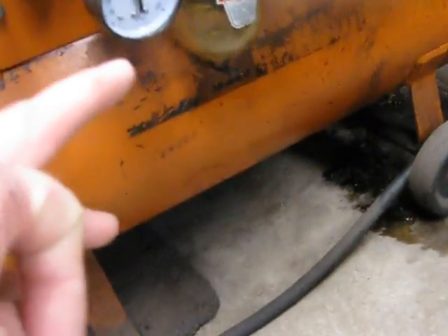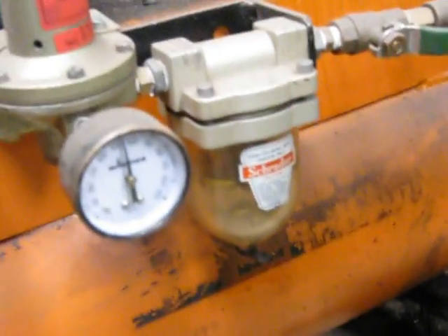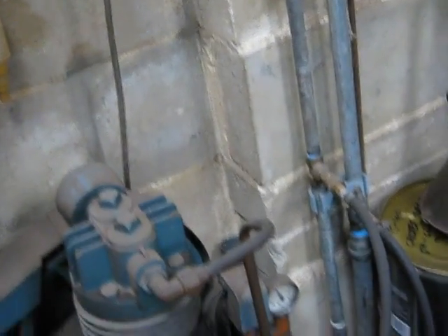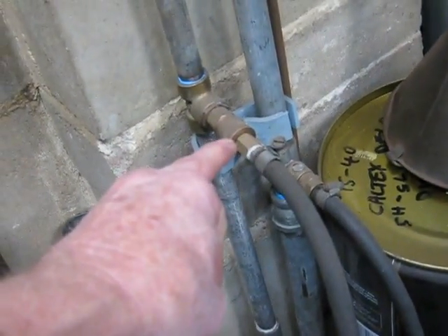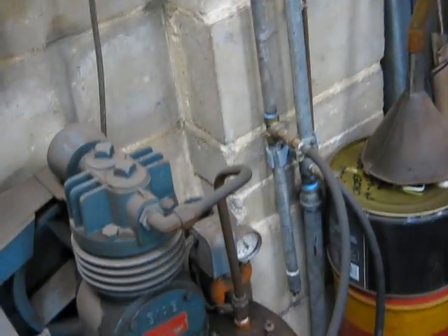This thing works so effectively that if you look at that filter, I haven't emptied it in 12 months and there's basically nothing in it — it doesn't get anything, because everything comes out in those pipes. So all you need is some scrap pipe. The pipes can be either vertical or running across the wall with some slope on them, just enough so that the water will drain back down and collect in the bottom, so your inlet and outlet are higher than the actual collection area. It takes out 99% of the water vapour.